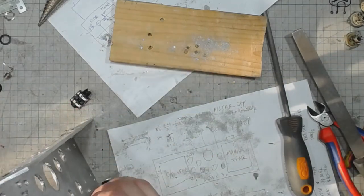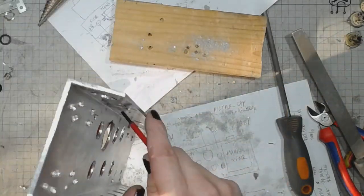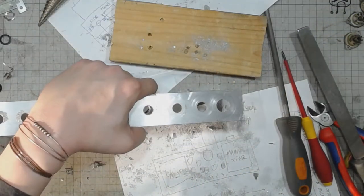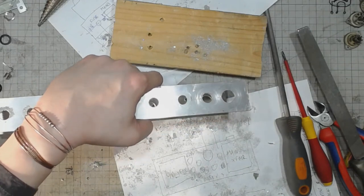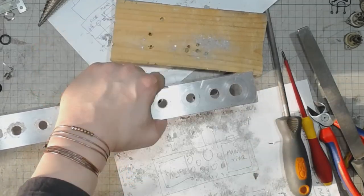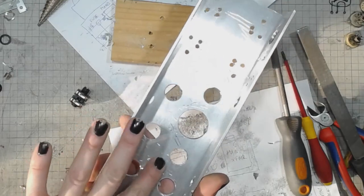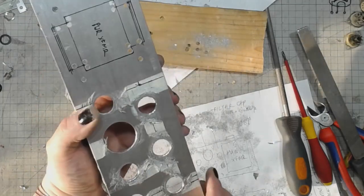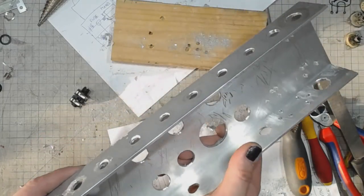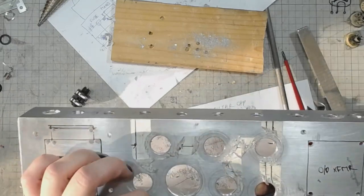And after I make the rectangular holes for the socket and for the transformers, I will scratch the aluminum with this typical kitchen implement. This does a very good job of scratching aluminum. I'm not sure if those kinds of scuffs from a file can be done away with, but this will do a nice job of cleaning and scratching the aluminum around the holes.